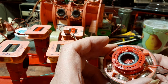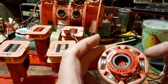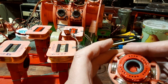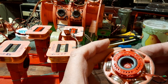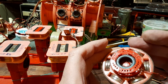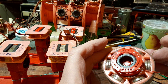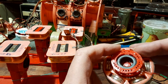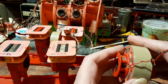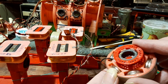I think it's glued in to keep the noise down, so I'd have to soak it with alcohol. Another change I want to make: I've got too many magnets in here. Instead of two magnets in each slot, I really just want one magnet per slot, because the more magnets you have, the harder it is to create the magnetic field lines you want. I was working at such a high frequency that I wasn't able to move those field lines very effectively, which is why it was less efficient at high frequency with the coil in the middle.